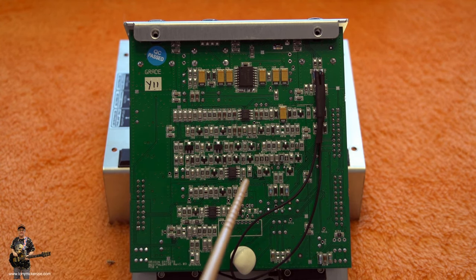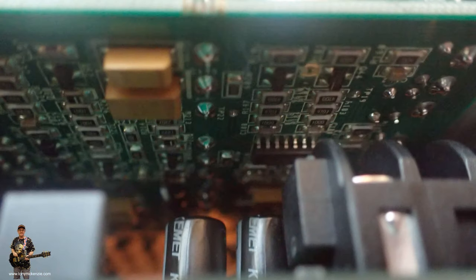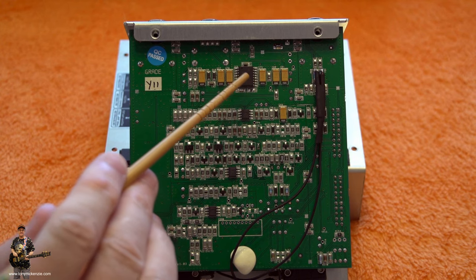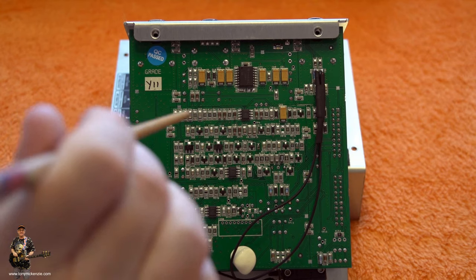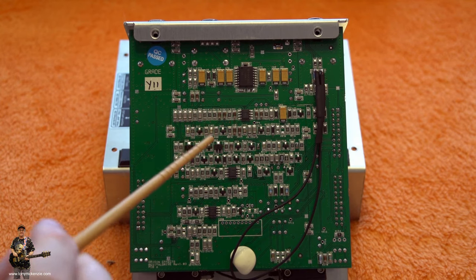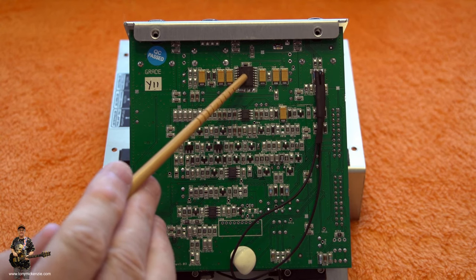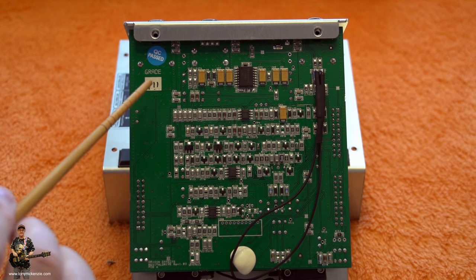But what do you do if you haven't? Well, you have a bit of a problem. Equipment might include a heater for this board, for when you're changing a chip like that, or indeed any of these. They often have a heater, and then an air blower that blows hot air onto this, so everything's kept at a nice temperature. You clean it off, put your flux on, and a bit of solder, a bit of cleaning, and put the new one on.